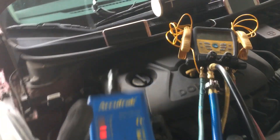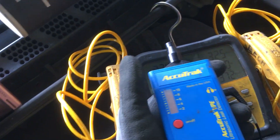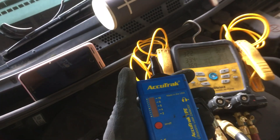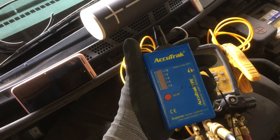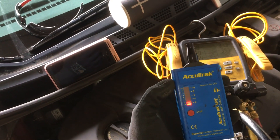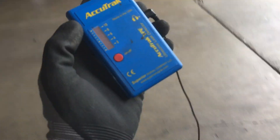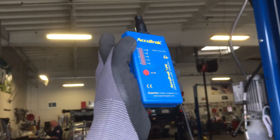This is video number five after I got a customer phone call and had to stop the video in the middle. Going back to the video, I had filled this up to 70-something PSI and it's down to 30-something. During my video call I broke out the AccuTrack ultrasonic, and as you can see how sensitive it is as I talk. Remember with these you have to watch out - some LED and fluorescent lights could make this thing go crazy.